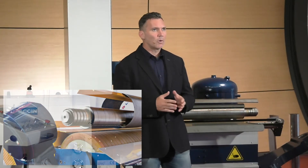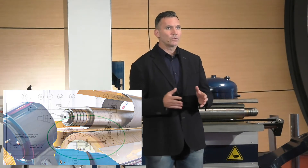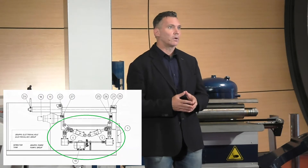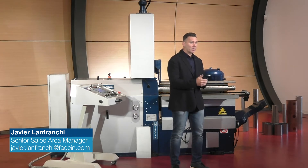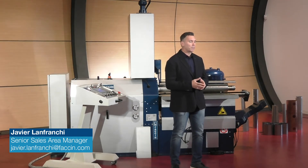So how does our HCU work? Thanks to the polyurethane coating of the bottom roll and the reversible positioning system — an exclusive feature of our machines that guarantees constant dynamic pressure — the plate is easily drawn by both rolls without any risk of damaging the surface, forming perfectly without any abnormalities. As a consequence, the operator can avoid the labor-intensive sequence of pre-bending, rolling, and pre-bending often executed by 3 or 4 plate bending rolls.